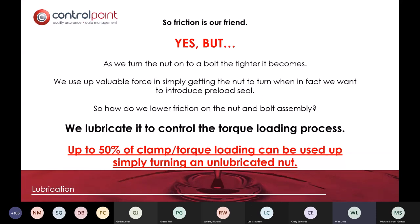if you do not lubricate your nuts and bolts. And there are many organizations that didn't realize this, but once you've given the lubrication to somebody and shown them how easy it is to actually put it on and then watch them assemble it, it is amazing to see the difference it makes just from an assembly perspective on how easy it becomes to tighten up a bolt to even 330 Newton meters, because the lubrication is overcoming the friction between the face of the nut against the washer face against the flange, etc., etc.